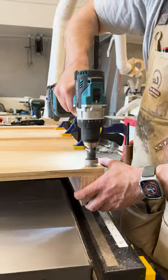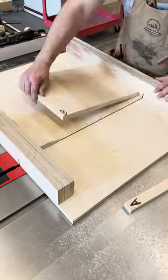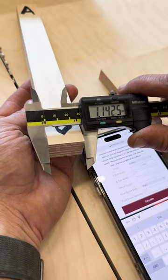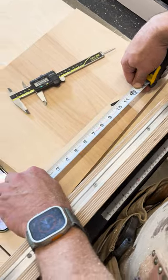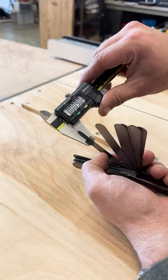Now to do this 5-cut method, we're only going to attach two screws — a pivot screw and one that we're only going to use that hole one time. We're going to run our 5-cut method using the free calculator over on our website. Input our values and you'll see we need to move it towards us 0.009.